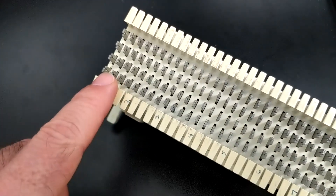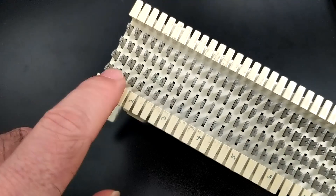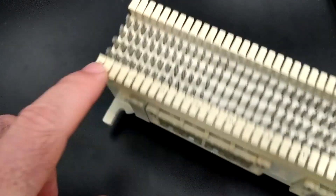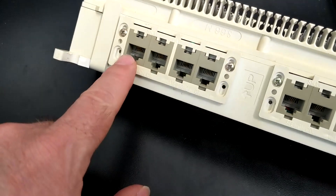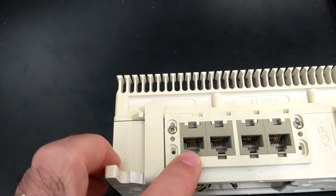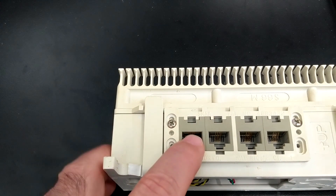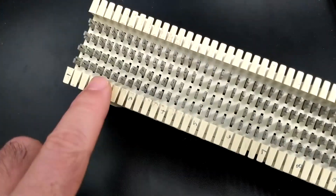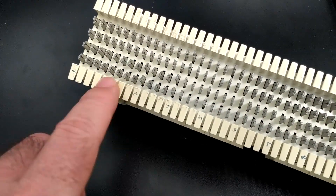The way this works is you've got a set of pins here and here — tip and ring one, tip and ring two — and then they go to the first modular jack on the side, which is shaped like an RJ45, but there's actually only four conductors in there. So these would be tip and ring one and two, and then your next one would go to the next tip and ring and so forth.